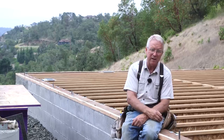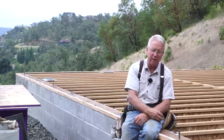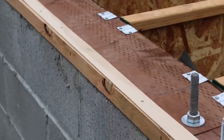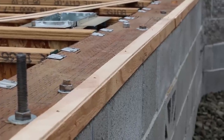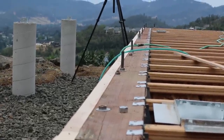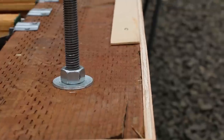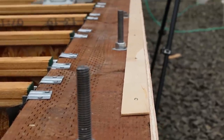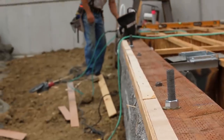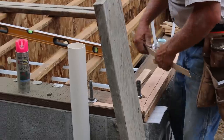I don't really want to overreact to that, because when I put the weight of the house on there, when there's 200,000 or 300,000 or 400,000 pounds of structure sitting down here, this board's going to press down flat. But I am putting an eighth of an inch shim on here to compensate for the distance of the top flange and the framing fastener nails. They're up a little proud, which puts a joist up a little proud. So we're up just a little bit right here. I think that's going to get the bottom plate of this wall sitting nice and flat, putting a steady down load on the ends of these joists so they don't squeak in the hangers. And hopefully we'll make a nice flat place to start the bottom plate coming up on these walls.